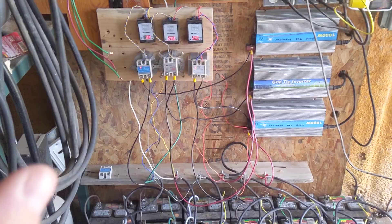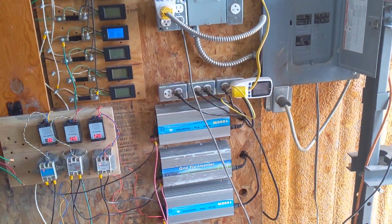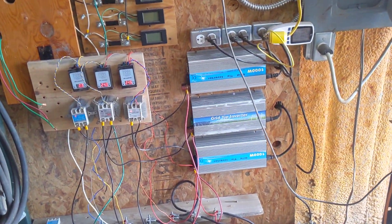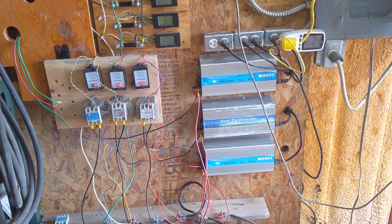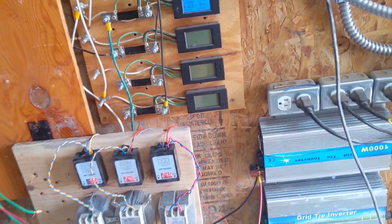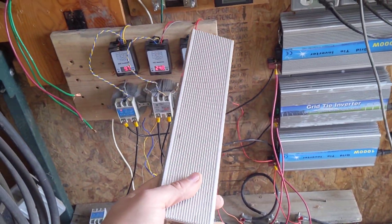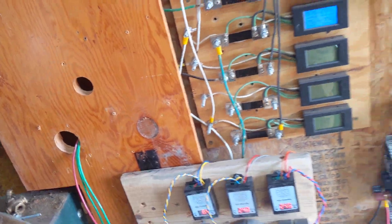That is how you connect all this up to run a turbine. You can use any kind of inverter — any kind of grid tie inverter, or just a standard inverter that you're going to plug your tools and stuff directly into. Now, if you are using just a standard inverter where it's not always going to have a load on it, you're going to have to have a brake controller — or not necessarily a brake controller, you can use the same thing as one of these switches. Whenever voltage gets too high, you have it kick on a resistor and that will bring your voltage down to keep from hurting your inverter and keep from blowing up your batteries.